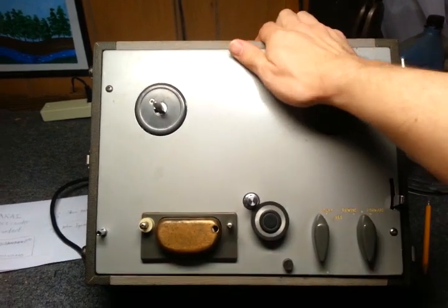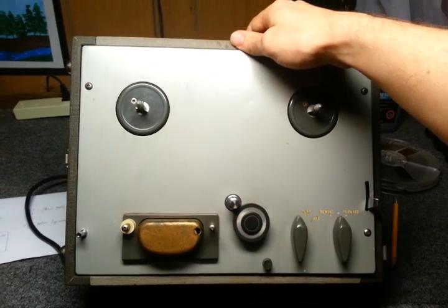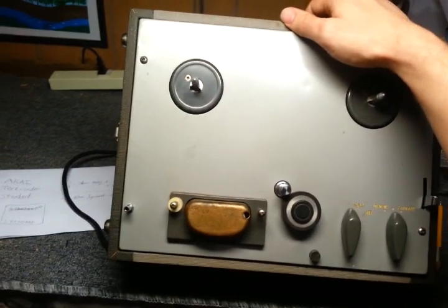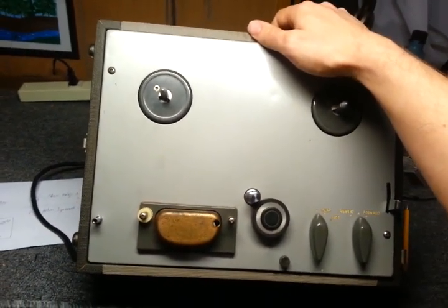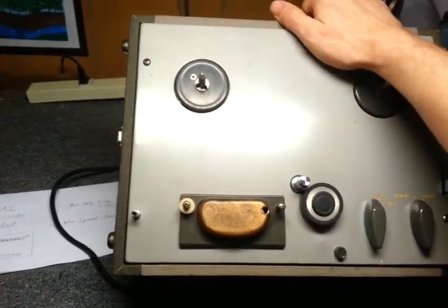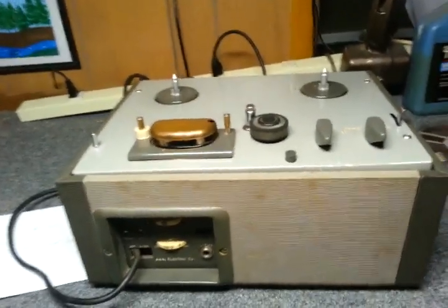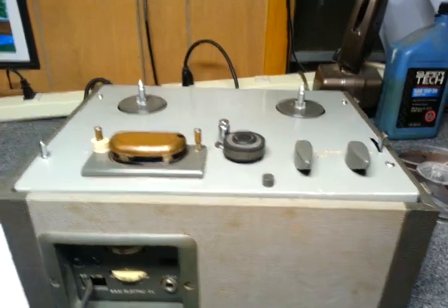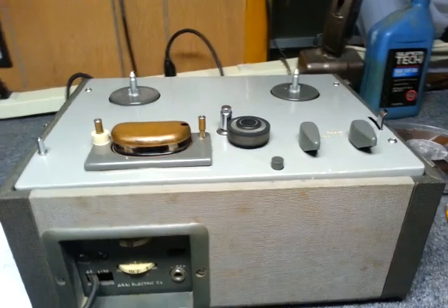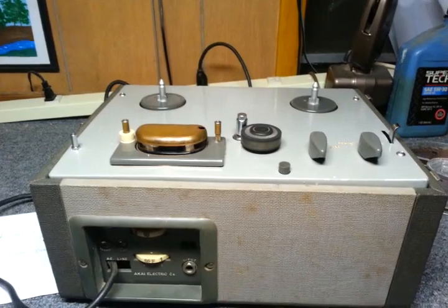One thing I greatly desire to do is to fix my wire recorders so that they would record properly. And maybe I could ask for you guys' help. I'm figuring it's only a problem of there not being enough voltage. I have three wire recorders, but one of them I'm able to record on fine, the standard business machines. But I have two others, a Webster Chicago 18-1 and a Steno by Crescent. And on both machines I've replaced most of the capacitors, or at least most of the non-electrolytics.